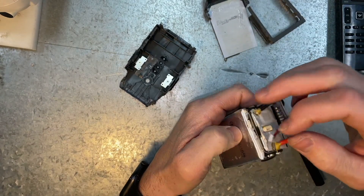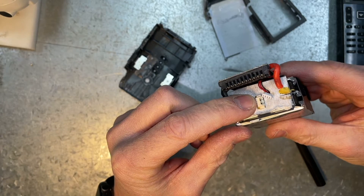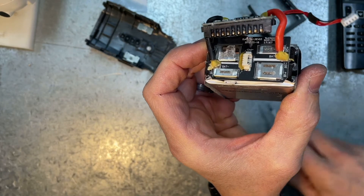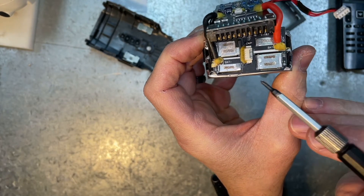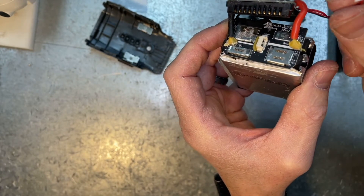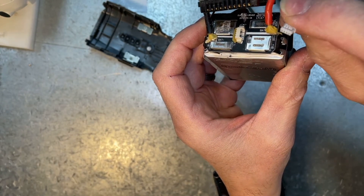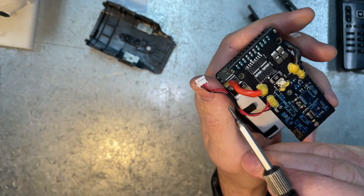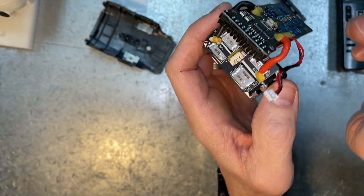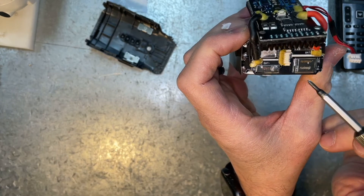Got the tape on the front here. This tape covers where the battery balance port is soldered to a board — it's soldered to the three cells. Remove that tape and here we go. This is where the short is. When I touched the plug with a steel pair of pinchers, I shorted out two prongs — the two wires at each end. Don't ever use steel tweezers pulling these plugs. It really messed up this board.